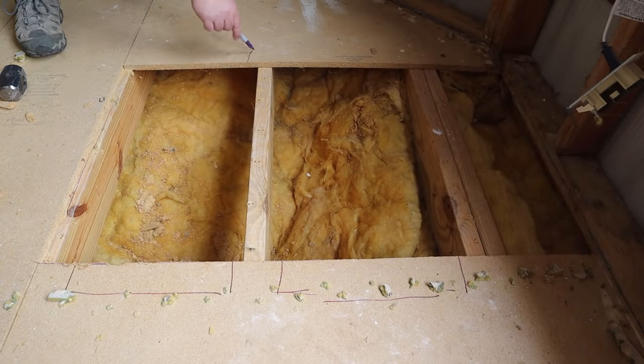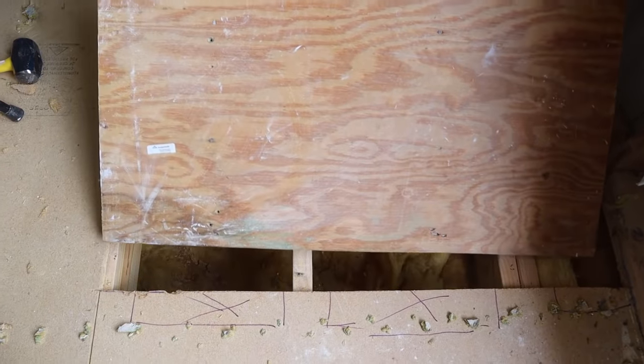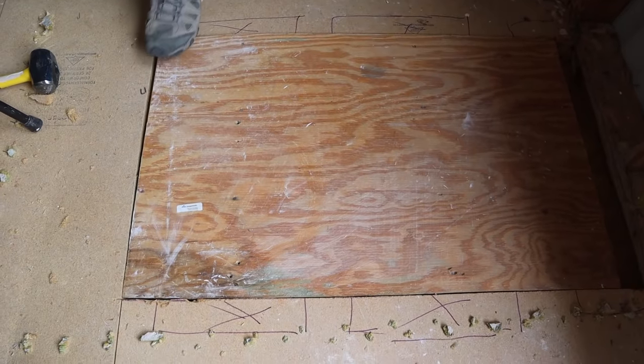This brings us to our second word: blocking. Blocking refers to pieces of two-by-four cut to fit in between your floor joists, laid flat on the bottom side of the floor, so you can attach half to the old floor and half to the new patch. This eliminates flexing and prevents your floor from breaking. Ninety percent of patch jobs that go south are because blocking was not done — there's inadequate support at the joints. In this example I would attach blocking around the perimeter where I've marked purple rectangles, put the plywood on top, and screw it down. Optionally, add construction adhesive to prevent creaking.